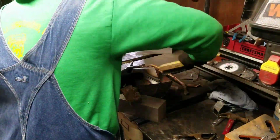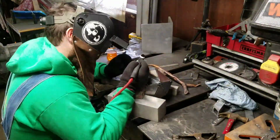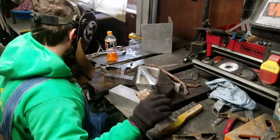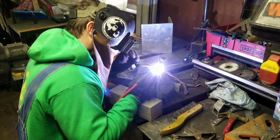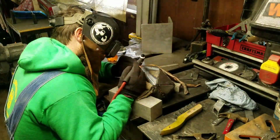So when I was designing this in my head, I imagined that all of these weld joints would be kind of like outside corner joints. But instead, they ended up being like fillet welds with a really bad fit up. And I say that because the weld joints butted together with only about a 3/16 of an inch opening, so there wasn't a lot of room to manipulate the electrode around. And my main priority was that I didn't chew up those edges, because we're going to come back and cap these welds with silicon bronze.